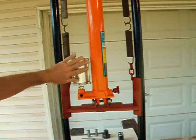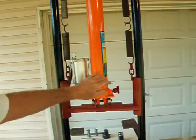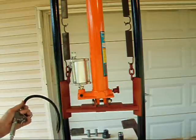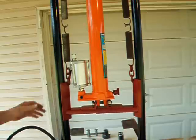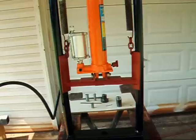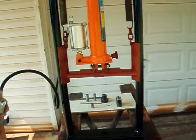Here's the ram air cylinder, and these are the guides that I set up for it. And these are some hood springs out of a boneyard — two hood springs on each side to pull the ram back up to its relaxed position. You have an on and off valve here for releasing it and tightening up when you want to go, and it just connects up to an air supply. You tighten the valve and push it and it gets slowly going down, and when you release it, it's going to bleed the hydraulics back and go up to its relaxed position. So what we're going to do is set it up to broach that blank in there for the bead roller.